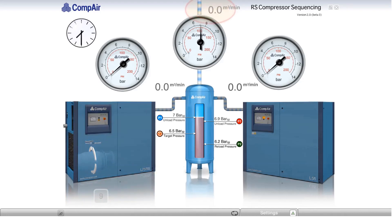With no system air demand, both compressors are shut down or in hot standby mode and wait for the pressure to fall. It's now 8 a.m. and production starts using 4.2 m³ per minute. The header pressure starts to fall. As the system pressure reaches 6.5 bar, the variable-speed machine starts and speeds up to the correct RPM to match the 4.2 m³ per minute demand.